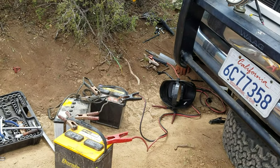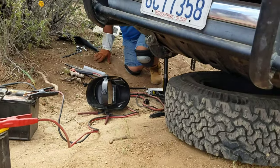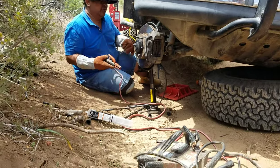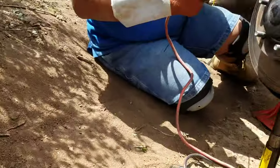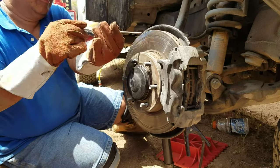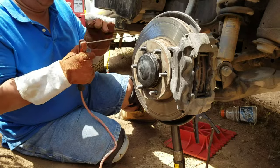If you are interested in how I modified this battery cable to accept a welding rod and also how I set up the three car batteries in a series circuit, stay tuned for the next video. So here you'll see me using a 6011 general purpose welding rod, and I am putting it onto my electrode holder, which you can easily buy at Harbor Freight Tools. So here I am scratching, exposing the arc electrode so that I can make a good arc as I start to weld.